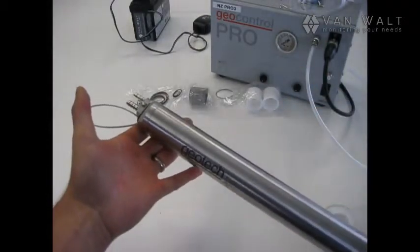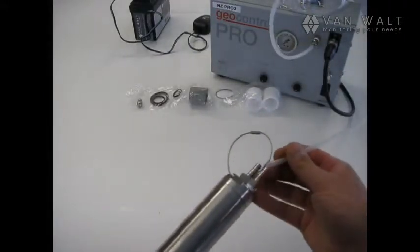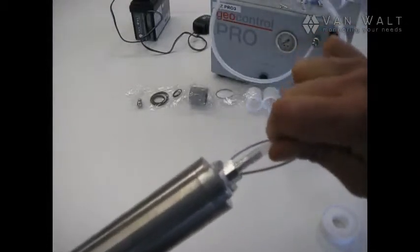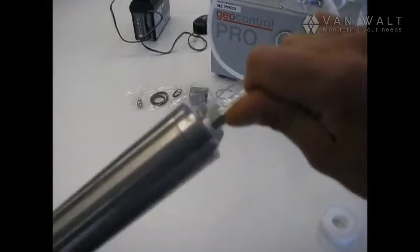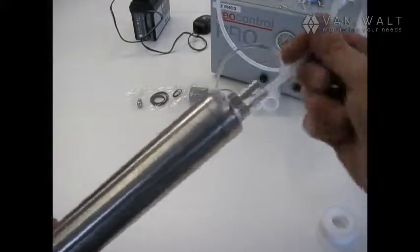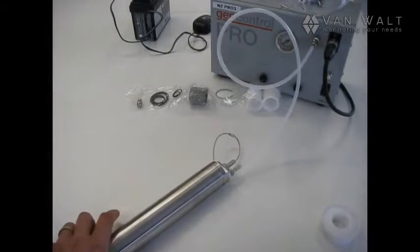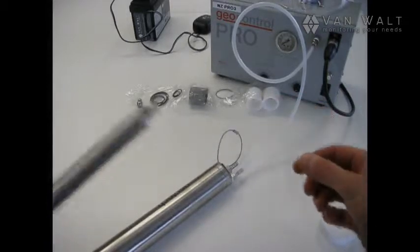Our pump's back together. And the last thing we're going to do is pressure test this. Once you've got this tube over at least 2 barbs, and the same here, that is actually strong enough to hang just by the tubing alone. We do have a hanger here on the larger pump. On the small pump there is no hanger, it hangs purely on the tubing alone.